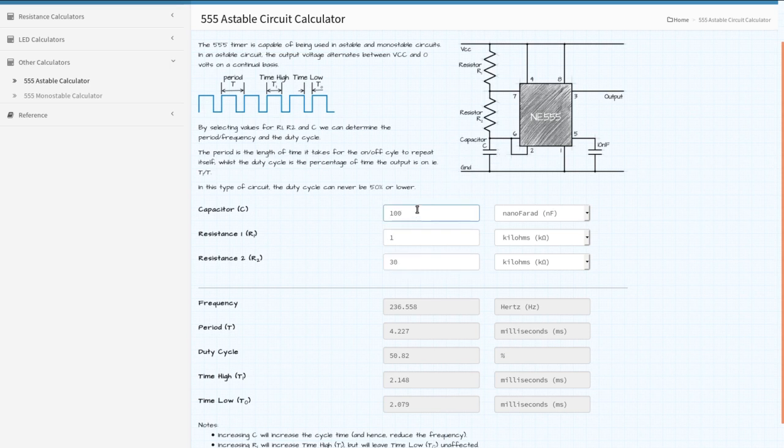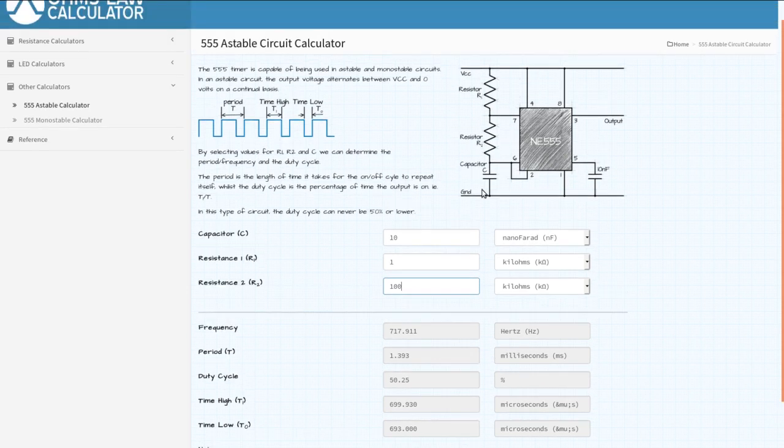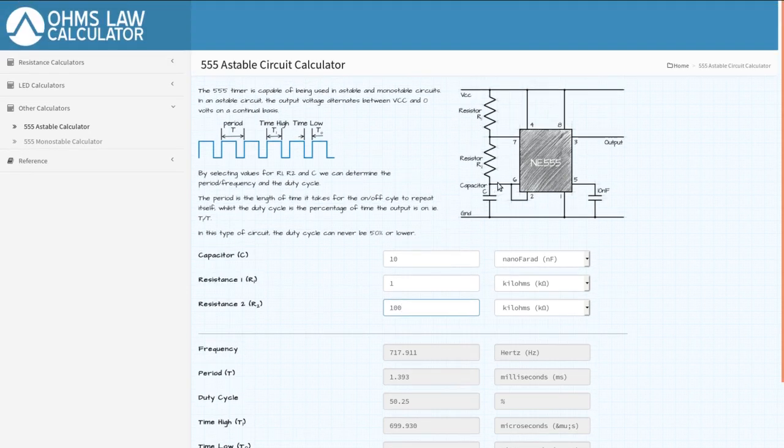We could also change that to a 10 nanofarad. And then, okay, 6 hertz is a little bit low for what we want. But we could put in bigger resistors and get the same thing out of it. So you can vary those. However, a variable capacitor is a little bit more of a pain to do than variable resistors. And we could do it with a whole bunch of capacitors too, right? Just switch in different capacitors with the buttons and leave the resistors alone.